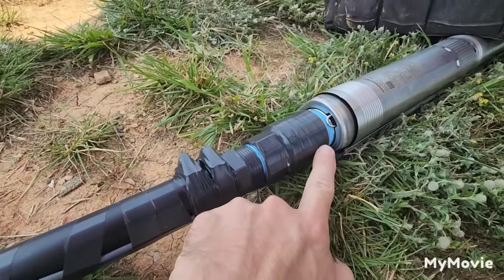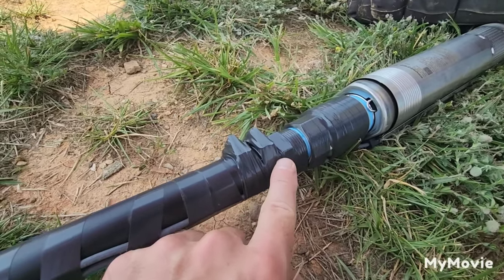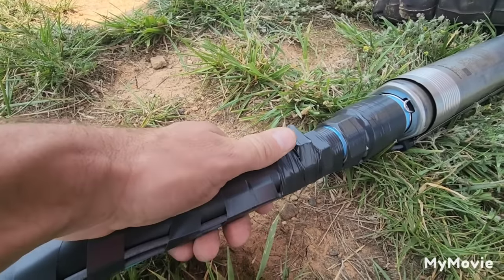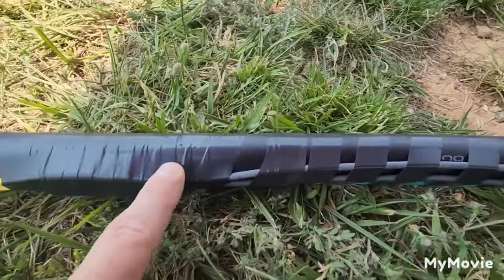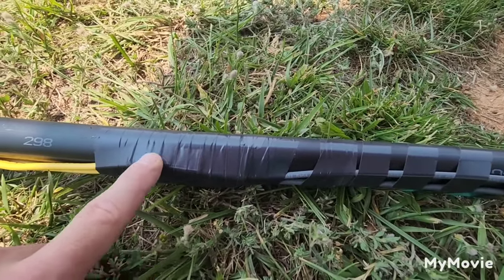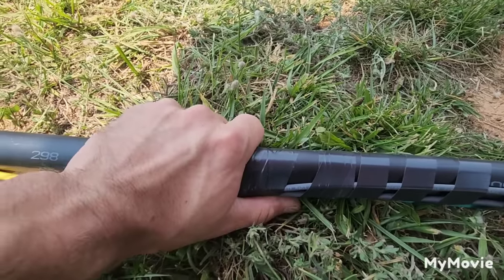I like to take my tape, keep it solid, cover your check valve, cover your fitting, and most importantly cover your clamps — this will help extend the life of your clamps and keeps the water off them. Then do a little candy-cane wrap all the way up until you get to the wire splice, and do a double wrap there — solid and then another pass to keep it nicely sealed up.